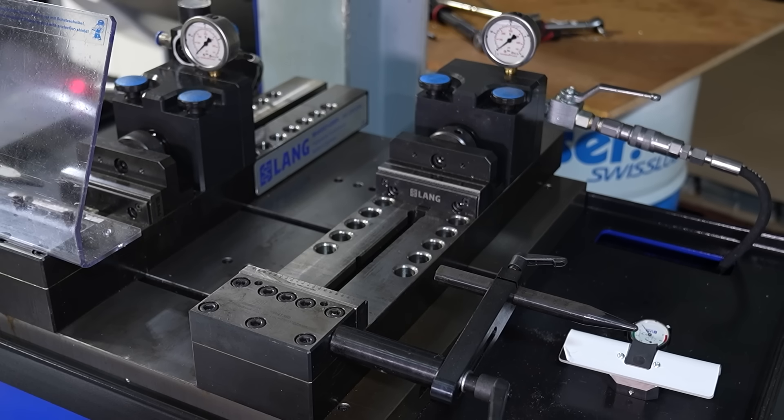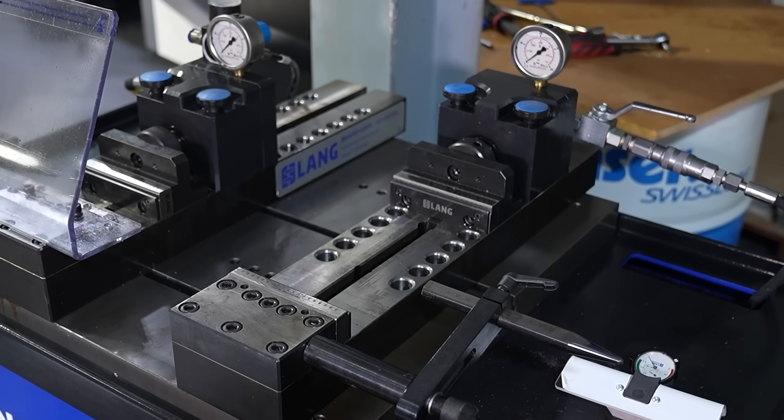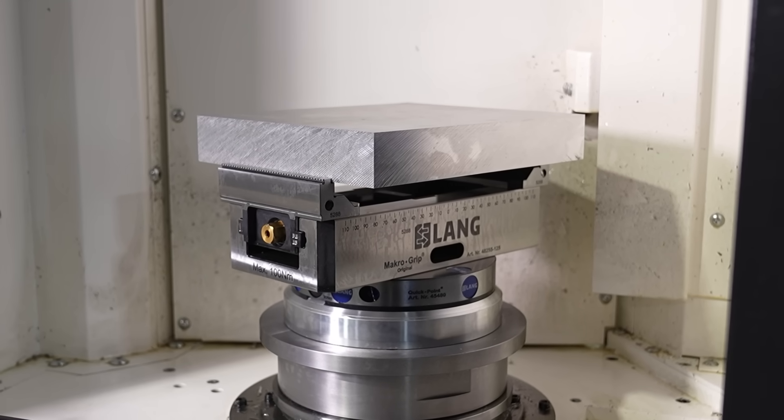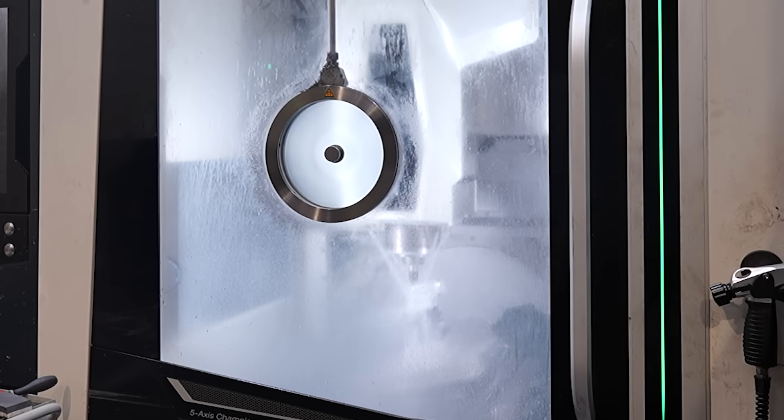This definitely overcomes that. We have a chart which gives you a torque setting for the vices based on the size and material of the workpiece, and people are always amazed by how low a torque you actually need. For a piece of aluminium with a hundred millimetres sticking out, you're probably only talking 50 or 60 Newton metres — and sometimes even lower, only 20 Newton metres. Clamping it as lightly as you can but getting a good holding force really deadens the vibrations of the material.